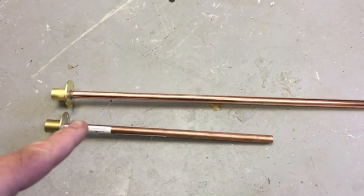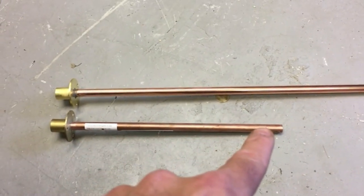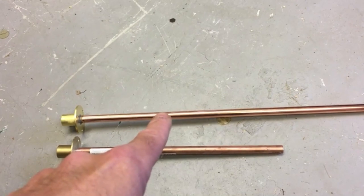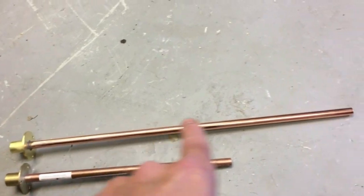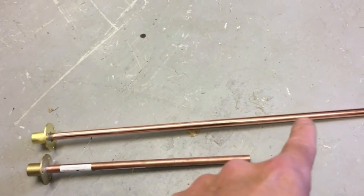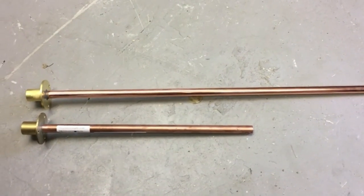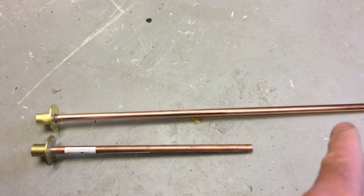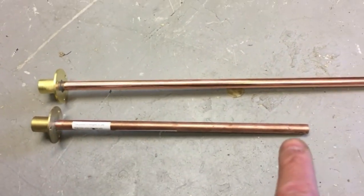This is my preferred method of doing an outside tap. They do come in different lengths — this one here is 400mm and this one is 600mm. The longer one is handy especially if you are working on an older property with thicker walls, like old cottages. It gives you the length you need to come right through without having a join in the middle — you don't want to be joining this pipe within the wall. Another use of a longer pipe is when you come through a wall and need to get through the back of a kitchen cabinet. On modern properties, the 400mm ones will be fine.